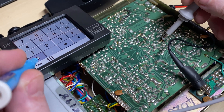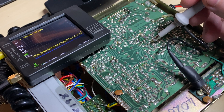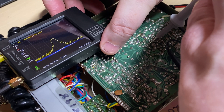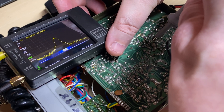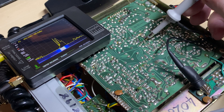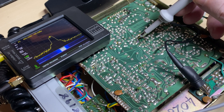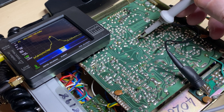And then the 455 kHz first IF amplifier — I'm trying to find where that is on the board. There we go — so we have our 455 kHz. Little did I know that when I was first doing this I was so close to the fault. A nice 455 kHz signal goes into the second IF amplifier and then out through L107. That then gets turned into the audible signal which is fed into the audio amplifier.